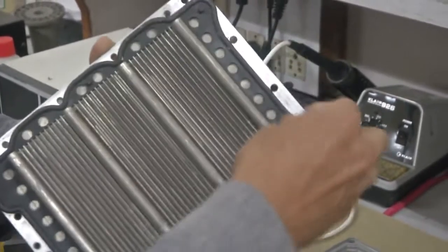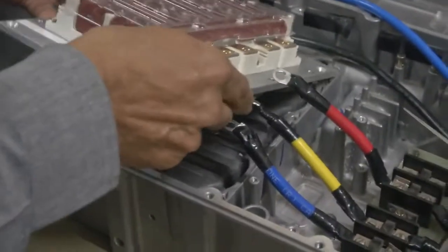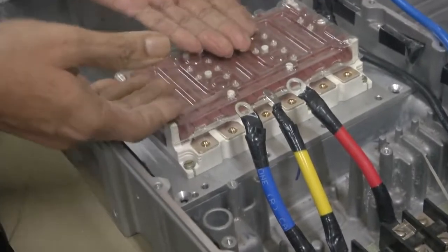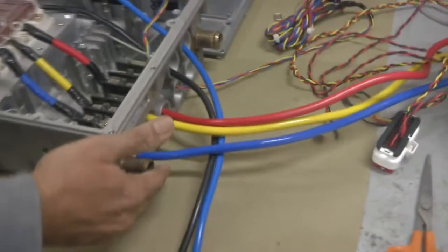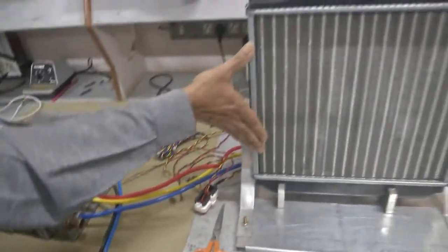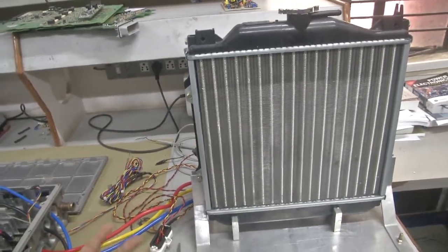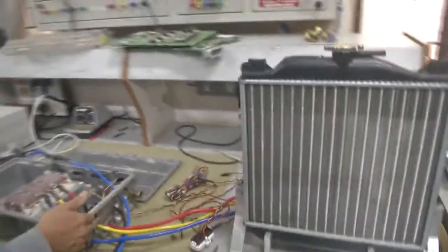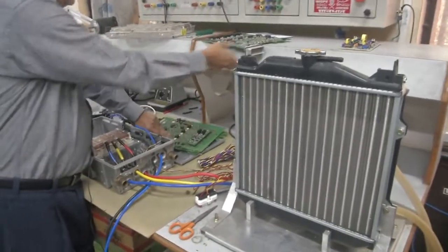Then there is a gasket here, and this gasket goes and sits here, and once the whole thing sits inside, this forms that part where the heat is picked up, the heat exchanger where the heat from the hot devices is picked up. Next you have this water cooling, the water channel here, and afterwards you have the corresponding heat exchanger where heat is exchanged to the ambient. And the moment you seal it, you see this comes with special types of connectors which I feel are equally important here.